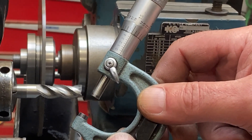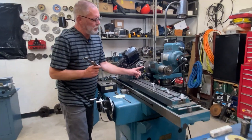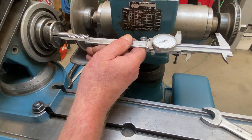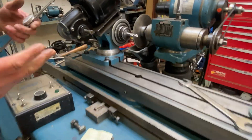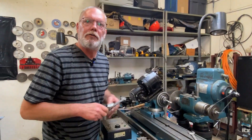There's the first one done. Before I took the last tool out, I measured from the nose of my collet to the end of the tool, so when I put this second tool in I used that same measurement. It was plenty close — within a couple thou — so I don't even have to adjust my end stops; I can just get right to cutting.